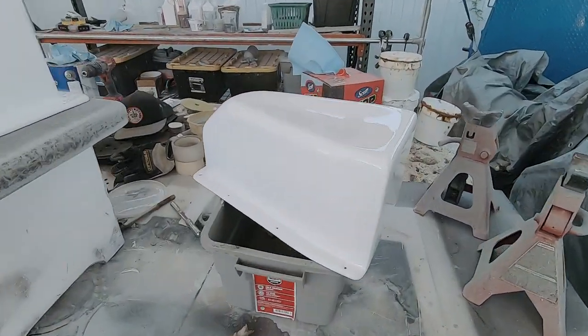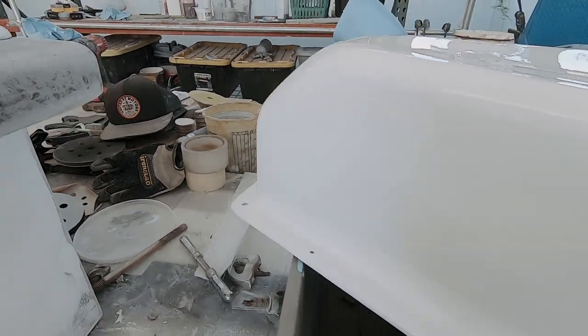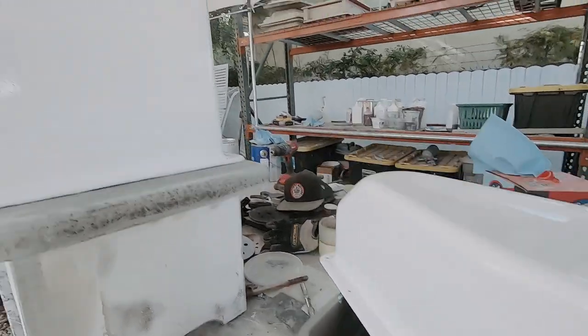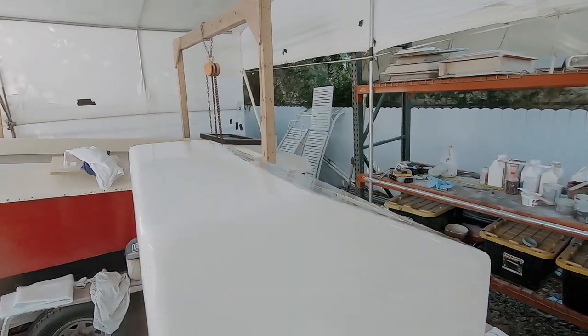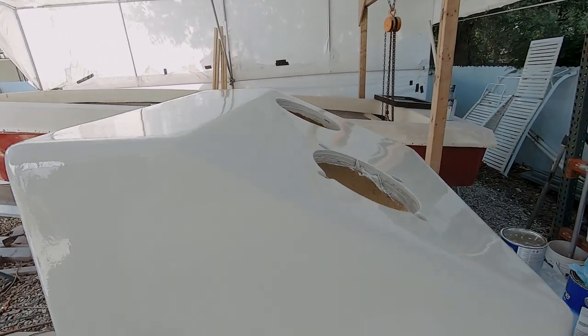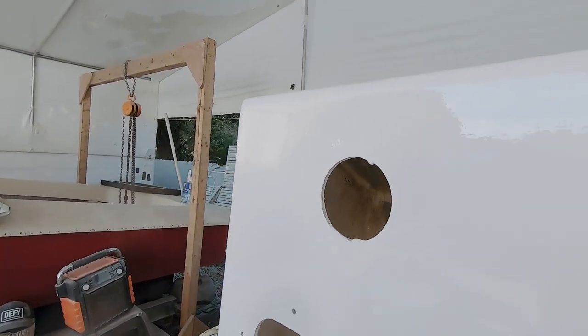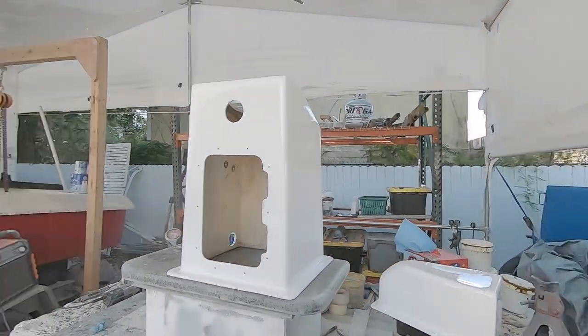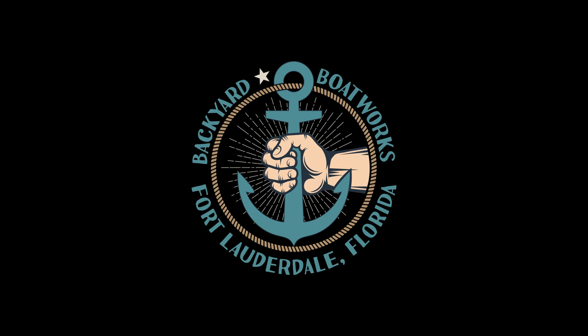That's a wrap on the polyurethane. I used a Sherwin Williams 4800 high solids polyurethane paint for this and I love this paint - it flows out so nice. I have a couple little pinholes there but I know where the customer is mounting this and he's not going to see those. The console came out pretty good as well - a little bit of orange peel in the gloss, but I can get that off real easy with some wet sanding and buffing. That's going to be a wrap for this short vlog - appreciate it guys. If you missed any parts of this, you can go back to vlog 004 to catch up. Thanks again guys, see you in the next one.